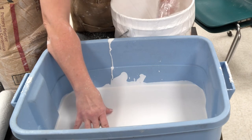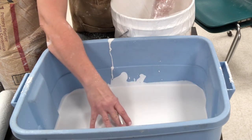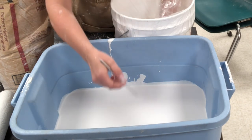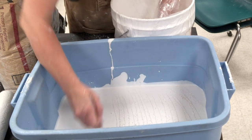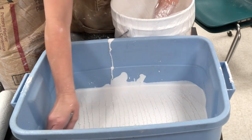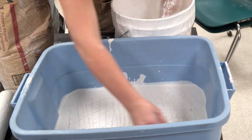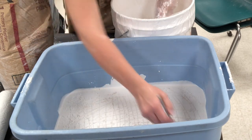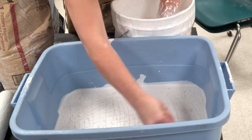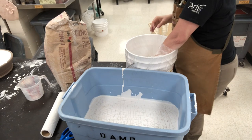The plaster I have in here is actually a little too thin for my comfort. I'm afraid that if I left it like this, it might be prone to cracking if we move the bin around a little bit too vigorously. So I had to mix up a little bit more. To add to it, I'm going to take and roughen up the surface like I'm scoring for clay — so I'm going to make some aggressive lines in here. That way when I pour the new plaster over, it's really going to settle in there and adhere well. Here's what the roughening up of the surface looks like — that is ready to accept the plaster.